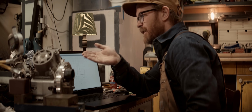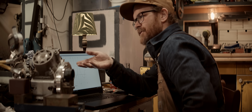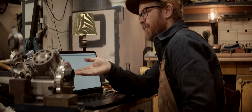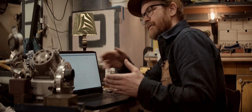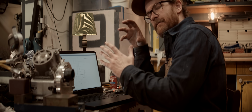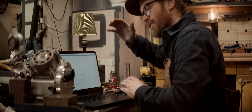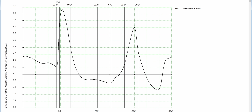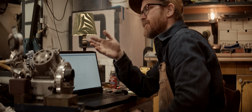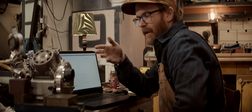I ran a simulation of the old engine in the Engmod 2T. Doesn't matter which engine, just a normal two-stroke with a pipe, just to have a look at what kind of exhaust pressure we could expect at top dead center. If you want real power from a two-stroke, you need the remainder of the previous exhaust pulse to strengthen the current exhaust pulse. To have that happen, you need a high pressure pulse in the exhaust colliding with the piston just before the port opens, and that pulse can join with the new pulse traveling, making the starting point for the new pulse higher in a way. So the exhaust pressure is not only high and probably pushing spent gases through the transfers into the crankcase, mixing with the fresh mix, but I've also created an outlet for that superpositioned pulse to relieve it and not have it strengthen the next pulse.